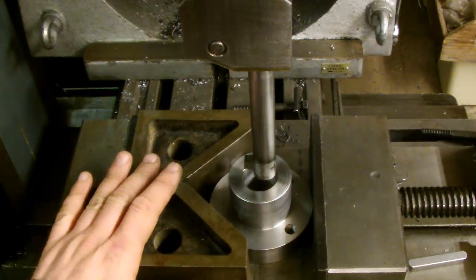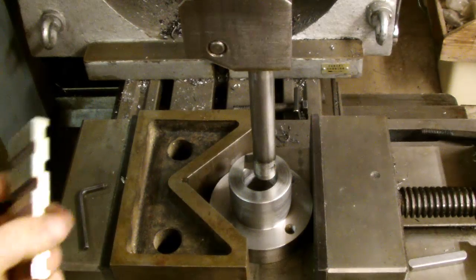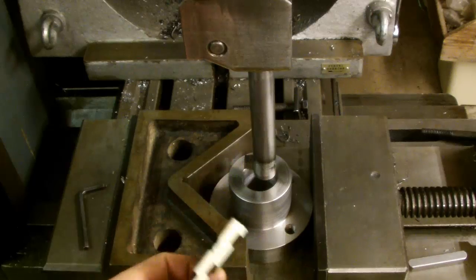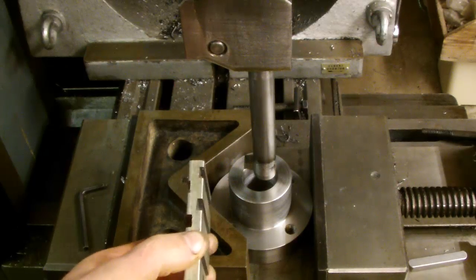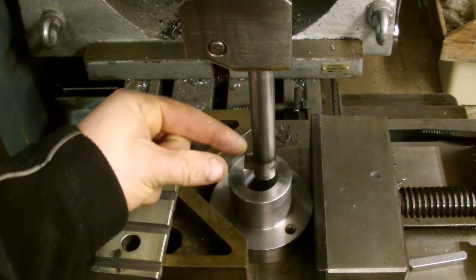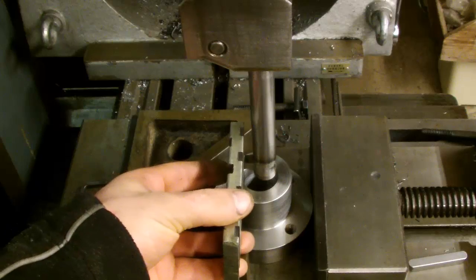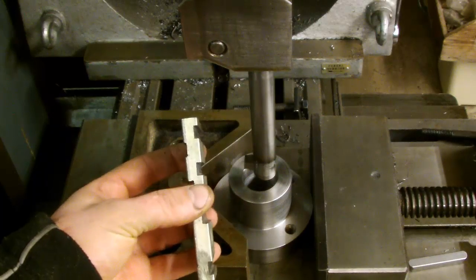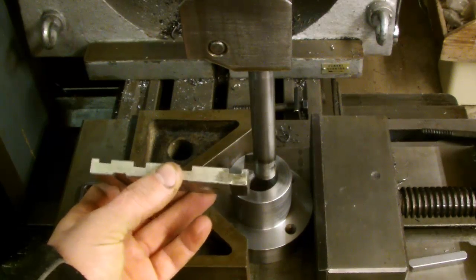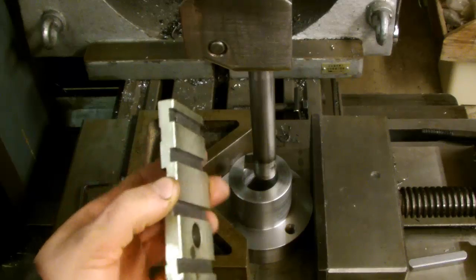This is the first time I've tried this one. I've obviously ended up with a lot more pieces of metal like this around the garage. I want to end up aligning the cutter to make sure it starts straight, because the last thing I want is the cutter to be rotated around and start cutting on one edge. Because the key will not really fit in very well — it would never fit in the motor shaft. The two would never meet up. So it's probably as well that I get a few pieces of metal like this so I can test the cuts are straight before I actually start.